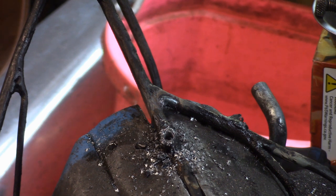It's got to wick up the walls or it's really not a secure connection. It does have to be free of oxides, or you'd have to clean it somehow. The total time doing all this was probably no more than a half hour, so the oxides didn't have a chance to build up. Right now I think I'm over-tinning some leads. You can see where I used the welding rod to add bulk to the crotches, and in a few places I made some random touches just to give it a little surface irregularity. The key is keeping it clean.